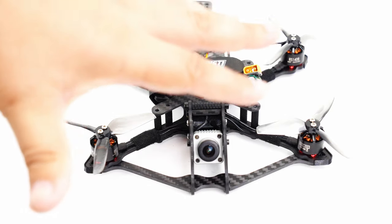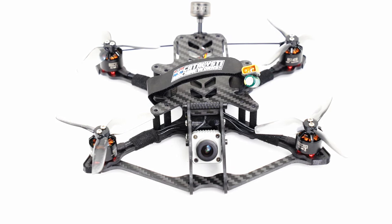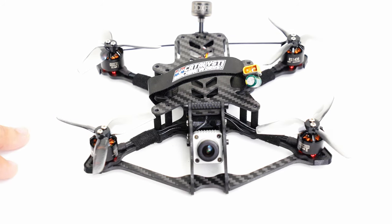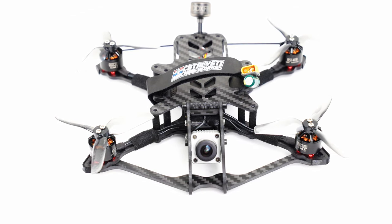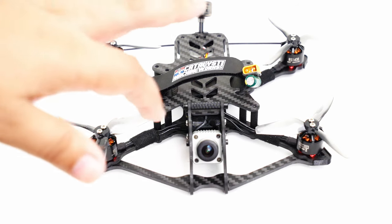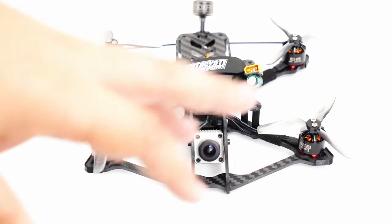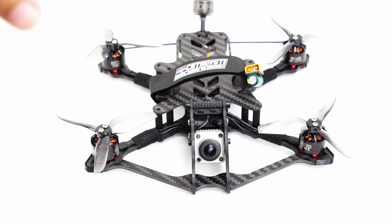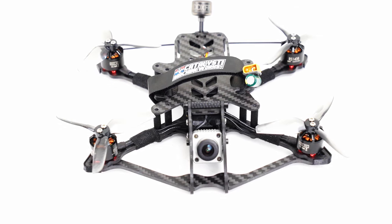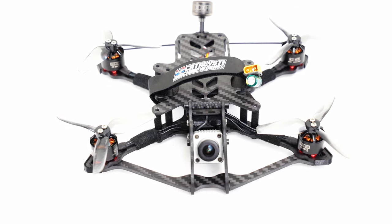This is the Johnny 5 edition. I went with a slightly different build formula than Catalyst to try to get a little bit of reduced weight and add a little bit of control feel. The Catalyst guys went with an Emax 1606, which gives you maximum amount of grunt and power, but I went with a taller 1408, which is a little bit lighter. I also did a couple of other weight savings tricks, ending up at 191 grams for this build. Still a little bit heavy on the freestyle side,